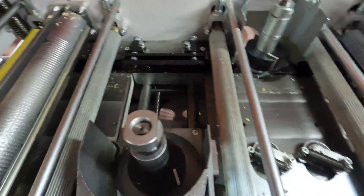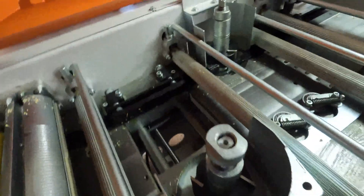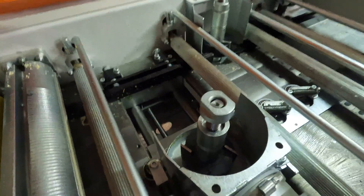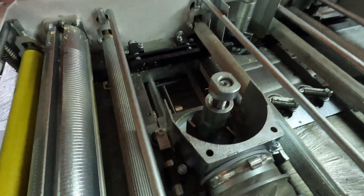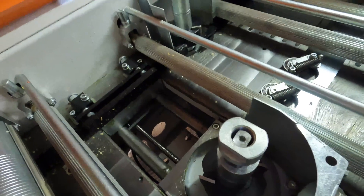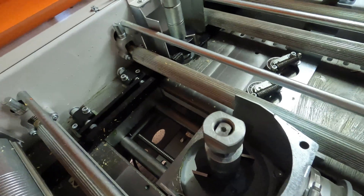The next head, the third head, is your movable spindle. The first spindle is fixed — that spindle doesn't move, the fences can move but the spindle stays fixed. This one I have a crank here on the side of the machine with an indicator dial, and I can crank this and it moves very slowly because it's very precise — you can see that head moves in and out.